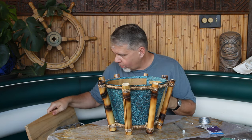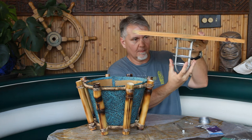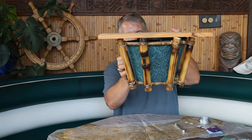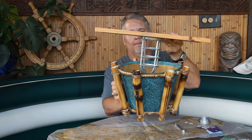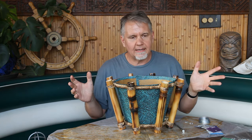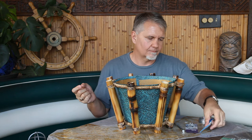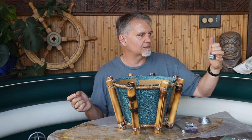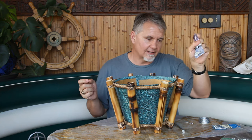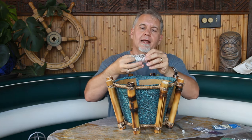I made a kind of a mock-up for my friend's location, and all the lights that these have to cover are flush with the ceiling with these kind of cages. So these have to go over the lights like this. My solution is to design a hook and spring attachment. I'm using these little extension springs, they're 3/8 inches wide by 2 inches long, some basic gate hooks, and picture wire, just regular wire that you would hang up picture frames.